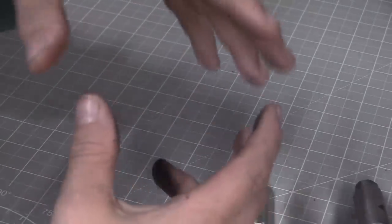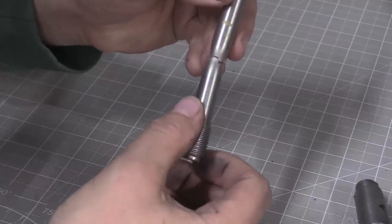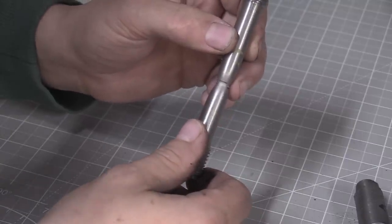It gets very complicated because it depends what the structure is, and some materials don't do this. But basically, you hit the yield point, and then this starts to stretch, and this is called necking, and it stretches and it stretches until it gets to the point where, no, we're done now.